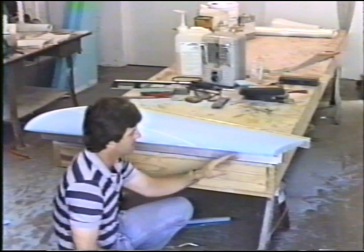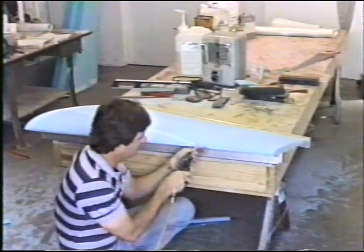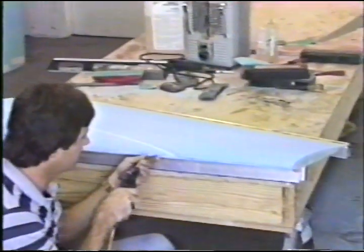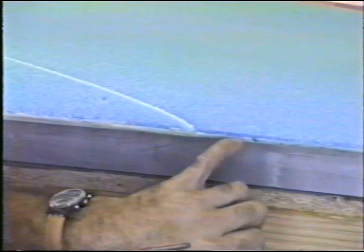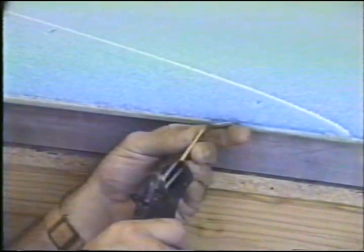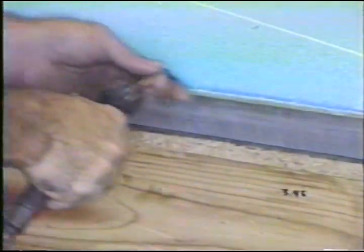What you can see here is that there's quite a bit of residual material left behind from the cutting process in the leading edge. We don't want this left behind, so we're going to grind it out of there. That little saw blade got pretty hot, and as it cut, it also melted away foam directly in the center line of the leading edge. Not to be concerned. We're going to backfill that with dry micro. Just before the line.